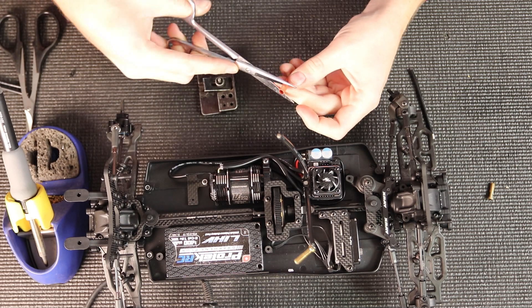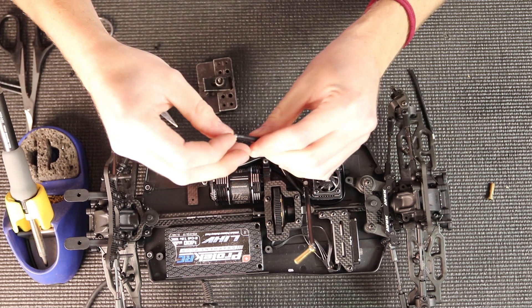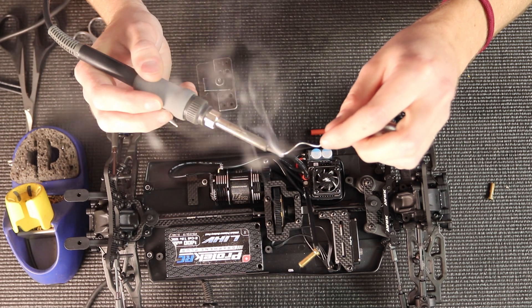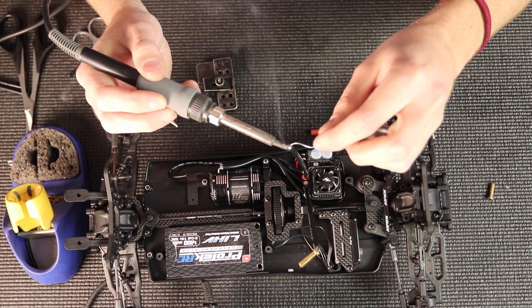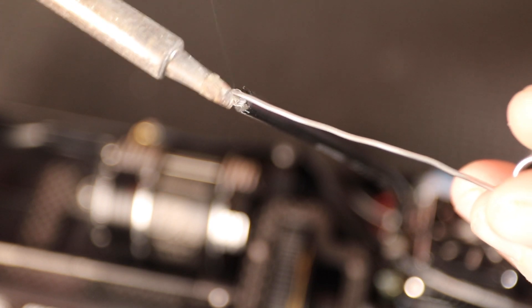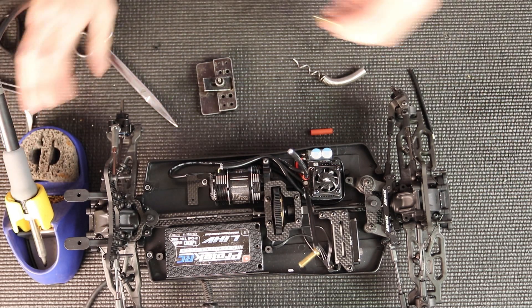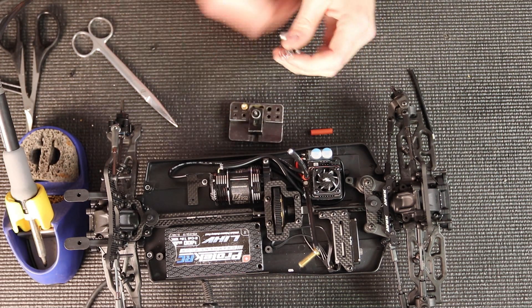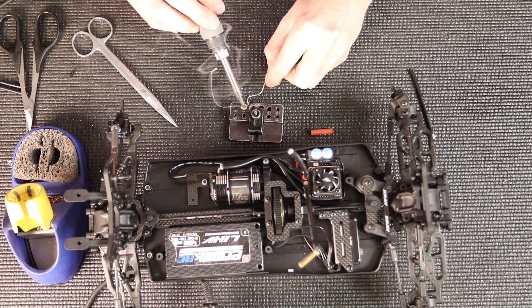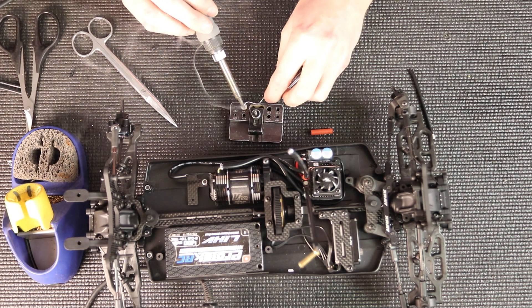For the positive wire I'm going to put a little piece of red shrink tubing on the wire. Once I put the bullet connector on, I'll shrink it near the plug so that when you go to plug your car in you can easily identify the positive — you don't have to trace it back to the speed control. Tinning means putting solder into the threads of the wire so it has a good hold on whatever you're soldering it to. Do the same for the bullet connector, keeping an eye on where the groove is, because once it's tinned it can be hard to see, so maintain the orientation of the groove so you can align the wire properly.